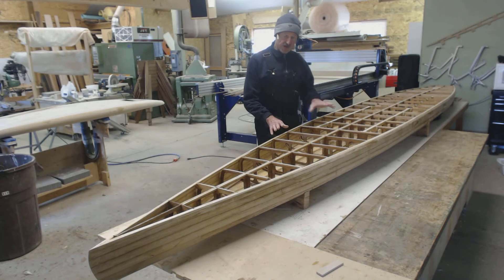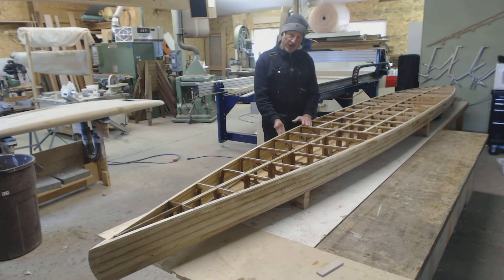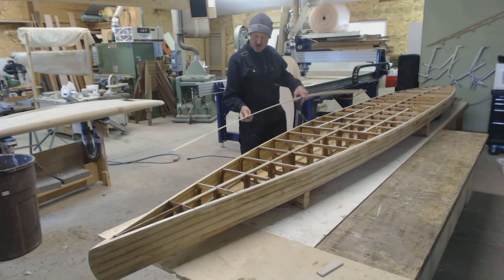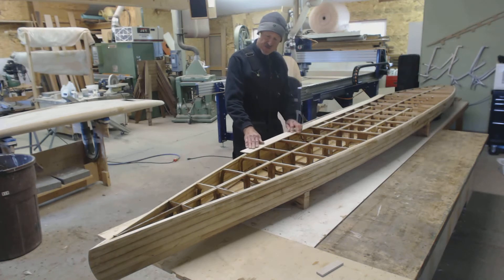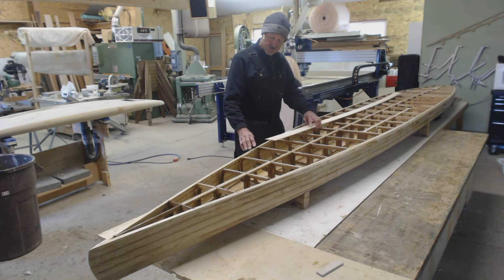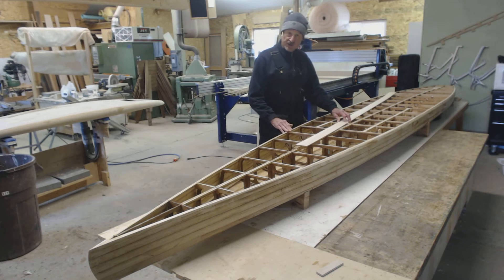In this perspective here, the board's flipped over and it's upside down — up is down and down is up. We brought our rails down and around the corner of the rail and onto the bottom, and pared everything off flush so that we'll be able to take our bottom strips and just lay those down over the framework. They'll glue to this portion of the rail, brought up parallel flush and in the same plane as the bottom of the frames themselves.